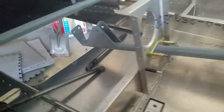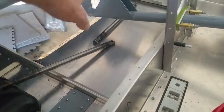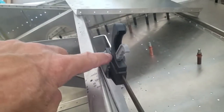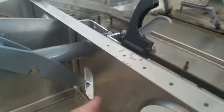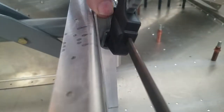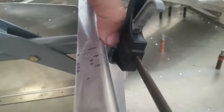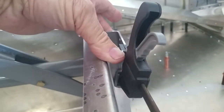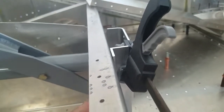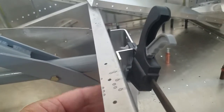Tomorrow I will paint these arms and get them ready to go ahead and put those in. I will move this to these holes here, and then this support gets bolted to these. What I'll do is put these up here, draw a center line, then clamp these together and mark from the back where the holes are and drill a couple of those on the drill press.